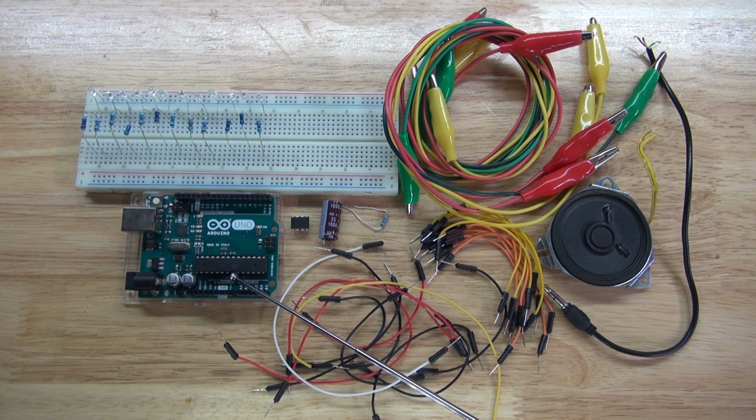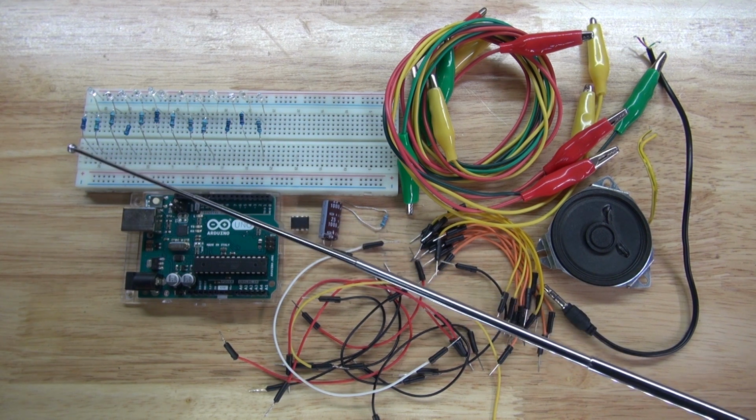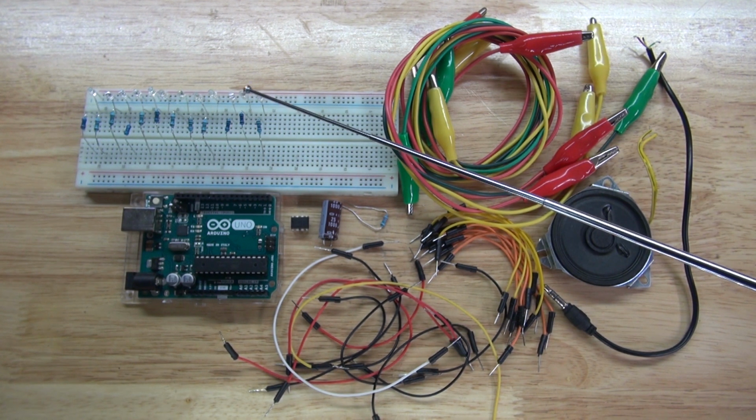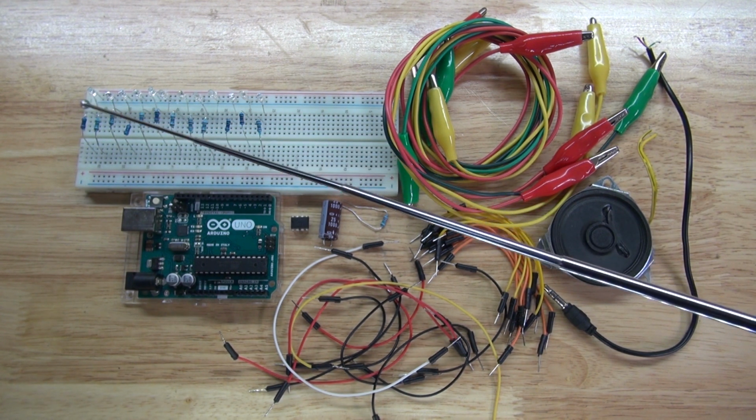and you're going to need an Arduino Uno, which I've already pre-programmed, and down in the description below, I have the code. And you're also going to need this breadboard with these resistors that are 100 ohms, and you're going to need 4 green LEDs, 3 yellow LEDs, and 3 red LEDs.